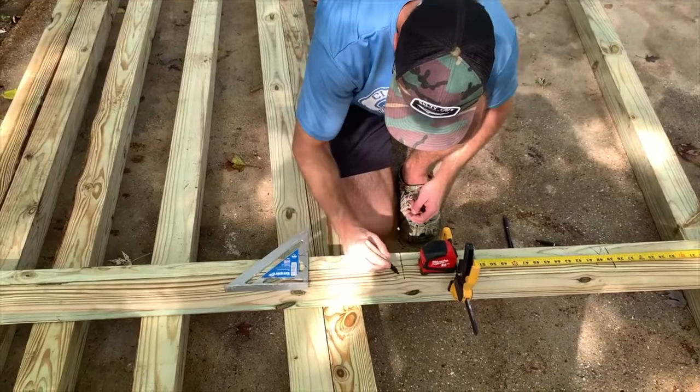So after positioning the first shingle in the second row so that the 1/4 inch overhang is maintained on the rake side drip edge, and so the bottom of the shingle is in line with the top of the wide cutout of the shingle below, you can then install your roofing nails. Install 4 for standard applications in the target nail zone, and use 6 nails if you're in a high wind zone. And here I am showing you how I'm maintaining a 1/4 inch overhang over the rake side drip edge.